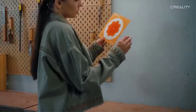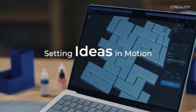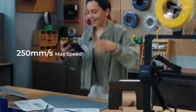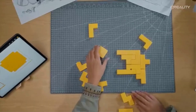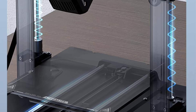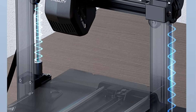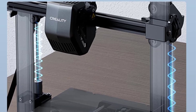The Sprite Direct Extruder is another standout feature of the Ender 3 V3 SE. This extruder design helps reduce the weight on moving parts, which improves print quality and reliability. The Direct Drive setup also offers better filament feeding and the ability to use flexible filaments without issues. The Autoload Filament System makes loading filament easy and hassle-free. The printer's dual Z-axis and Y-axis setup provides added stability and precision, helping reduce wobble and improving layer adhesion and overall print quality.